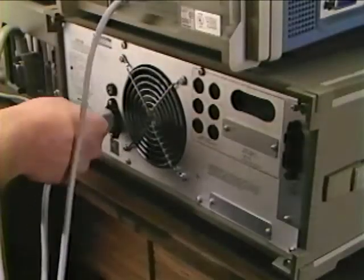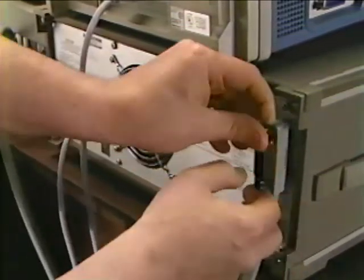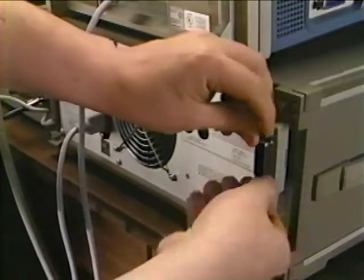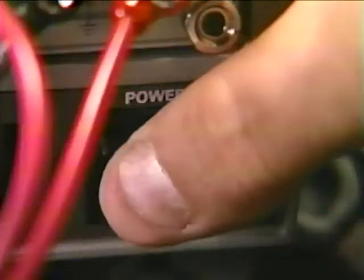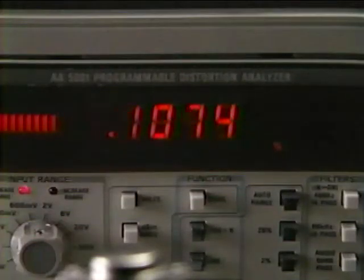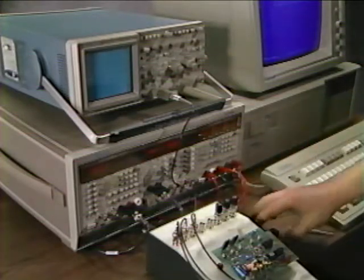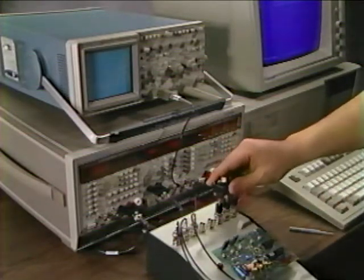With the convenience of plug-in rear interfacing, a single GPIB cable and power cord per mainframe are all you need — you'll save on cabling. Extensive diagnostics capability is built right into TestMate. Each instrument performs an extensive self-test on power-up or on command, and in case of a fault, displays or sends an error message over the GPIB indicating the nature of the problem.